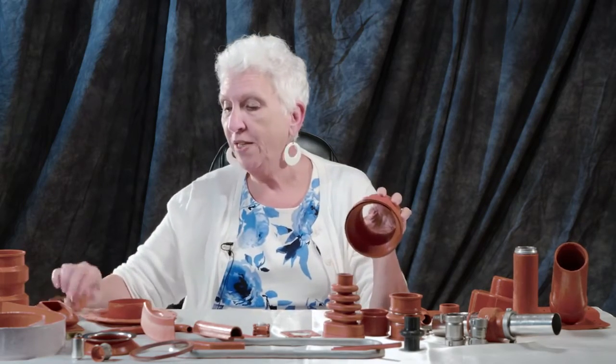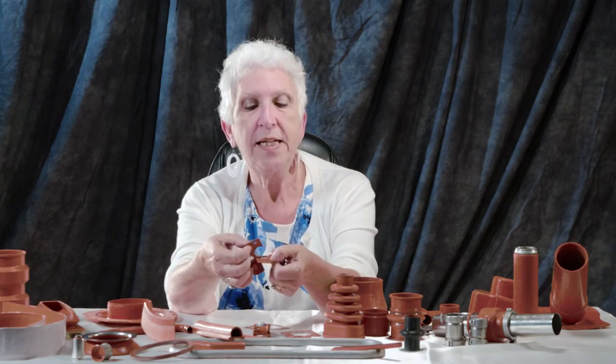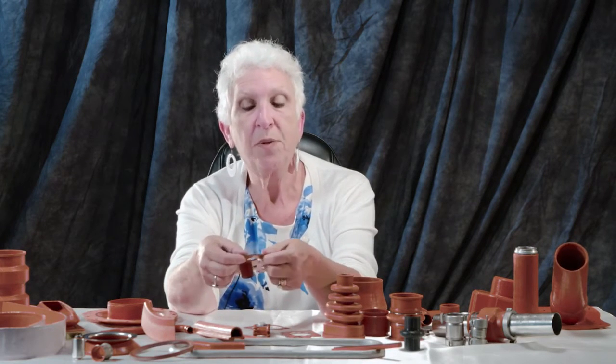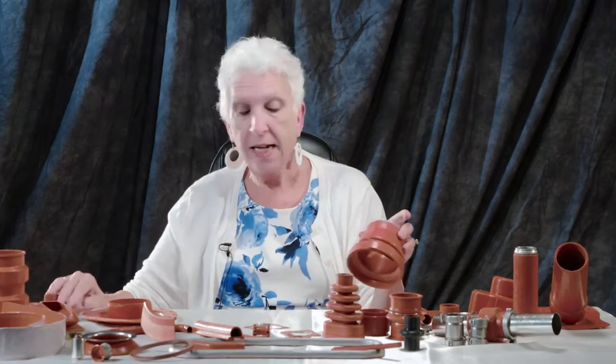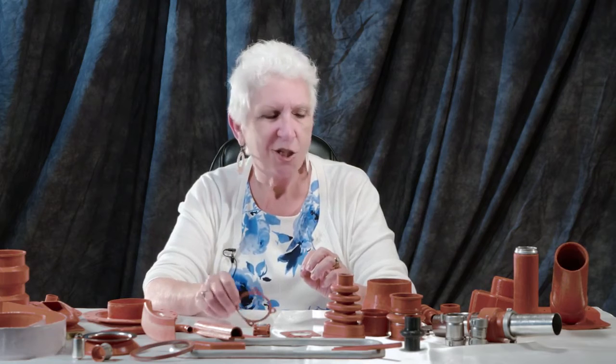That's what led us to these kinds of configurations, because through empirical testing, we discovered that we really only need about a 1/4 inch overlap to be completely fireproof. That works in ducting as well as in gaskets. And in fact, we are currently doing for NASA a 9-foot diameter U-shaped seal that will be made to install on its own, overlap, be bonded together, and move. It's 2 disconnected cylinders, completely independent, that move in any direction. So it has to be able to move in any direction and still seal. Interesting challenges we get.